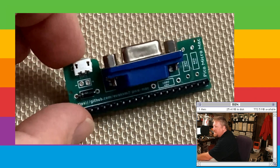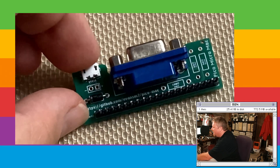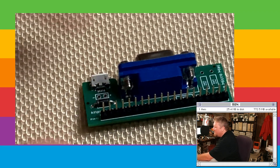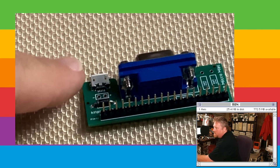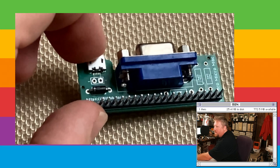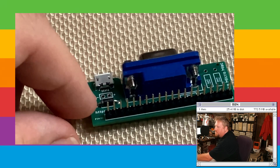This adapter here basically cleans up the design and makes it something easy for people to just add their own Pi Pico and fly. The board itself just has a VGA connection and a micro USB connection for power — that's the connection the Pi Pico uses, so you've probably got a million of these PSUs laying around. If you don't like that, there is a two-pin 2.54mm header where you can hook up whatever you want, and you can have a little diode in place to protect your power.